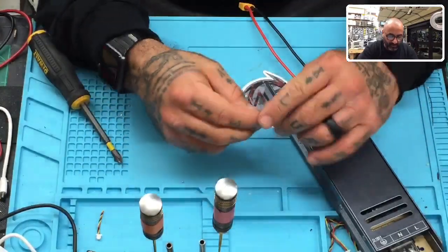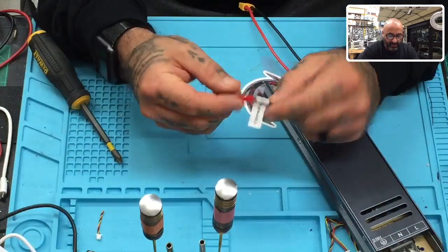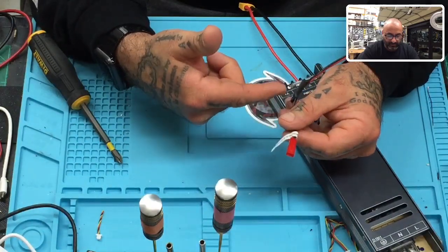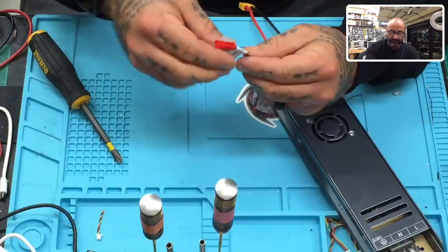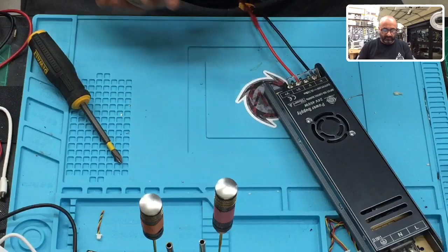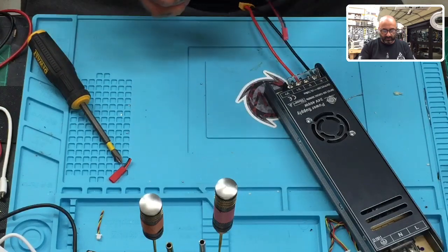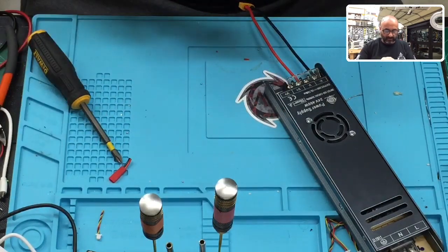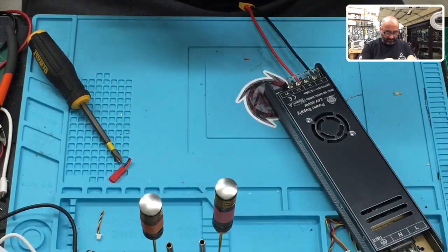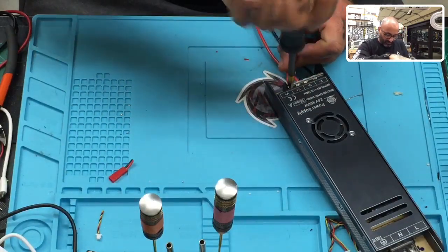Not everything needs to come out at that voltage, so I'm going to use a step-down converter right here. As you can see on it, one side says connect to the battery side and the other is the output side. You bring in two to six S of power and it puts out at 12 volts. First thing we're going to do is cut these ends off, strip them, and you can tin them if you want. I'm going to leave this piece of paper on here — I like to leave any warnings on something especially this, because people get complacent and mess it up.